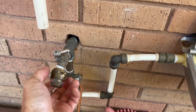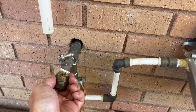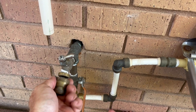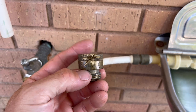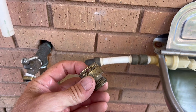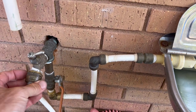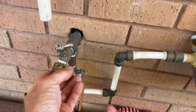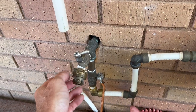All that water would go into the water supply and possibly contaminate your water supply or the city water supply and your neighbors'. That's why sometimes they issue boil water notices when there's contamination, cross-contamination. This one has been disabled. There's a set screw — a little screw that you have to put on here. It comes on there and when it gets inspected, they have to see that the set screw is broken off.